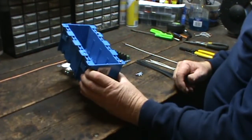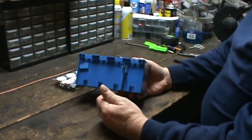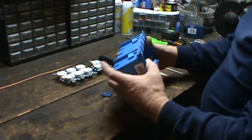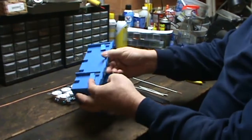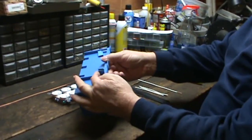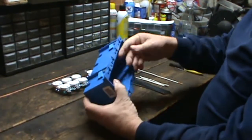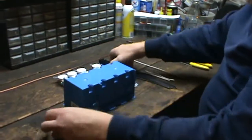The first gang box right here - I like to use the gang boxes that have the tabs on the sides, because all you got to do is cut a hole for it, slip it in, and when you tighten it up the tab will stand up and pull right up tight. So you don't have to worry about nailing it or screwing it into the box.